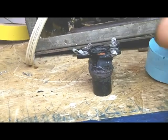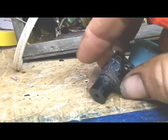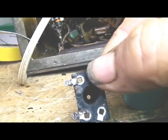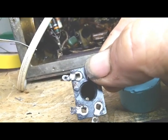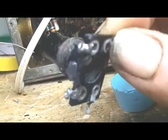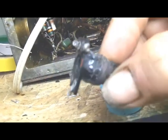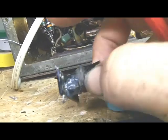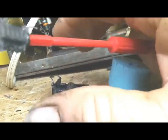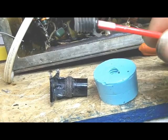However, I did take some inductance readings on this coil when it still had the old original slug. Its slug was screwed all the way down inside, and it was frozen in there. I had to bust it up to get it out. In the process, I also busted up this coil form, but I repaired that with JB Weld. So I'm going to take this now and take some inductance measurements with this one and see how close it comes out.